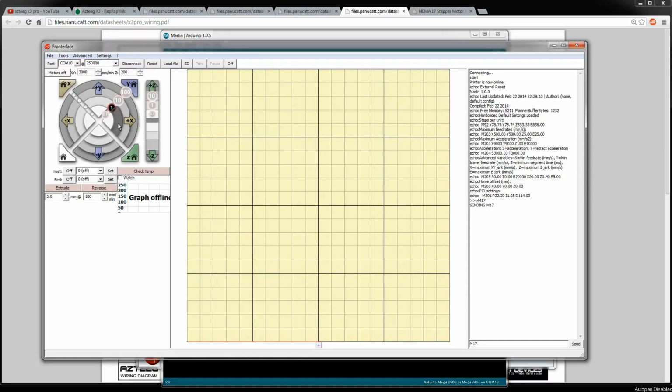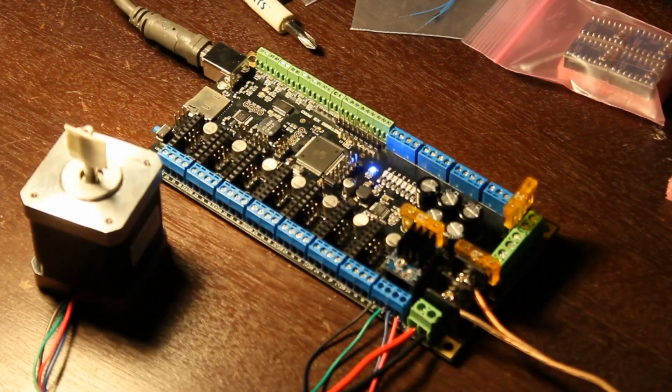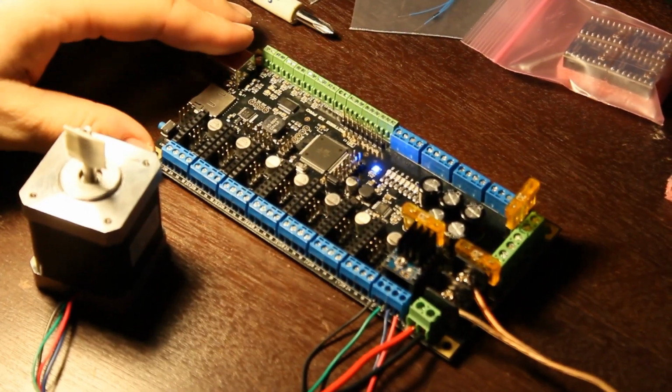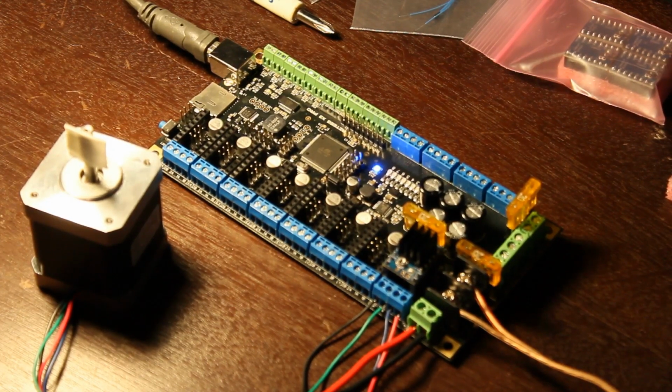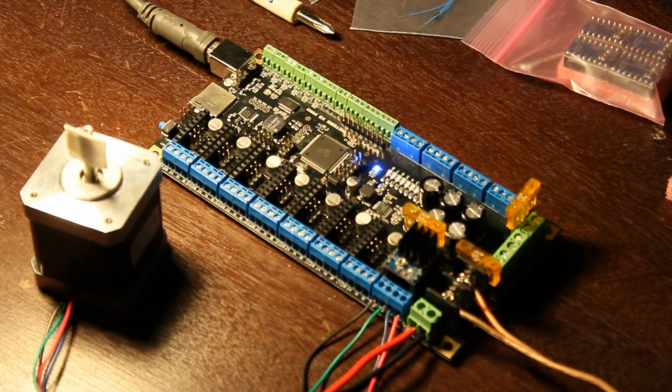The same would go if we went ahead and hooked up the other stuff, the other steppers, and check. Always do a spot check, make sure nothing's getting too hot. This is all good. Probably leave this running for a while and just make sure nothing gets crazy hot. But otherwise, I think we're in pretty good shape. Ready to start wiring some stuff up here pretty soon. Pop the other drivers in there and start running the bigger motors.